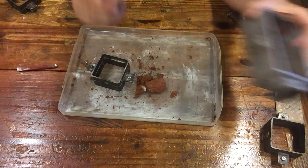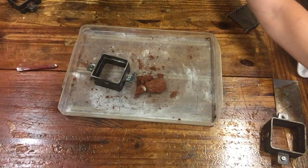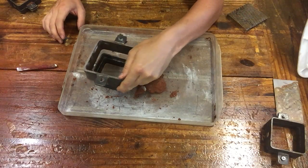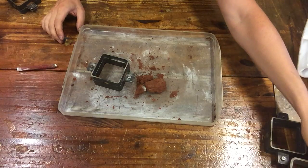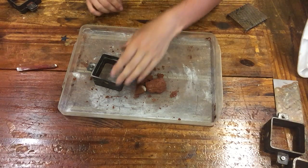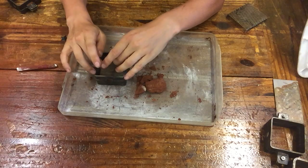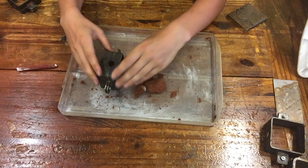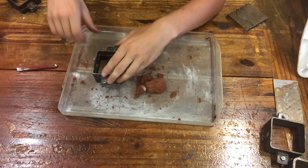If you're doing jewelry in the home studio, this is a good way to go. This is three-inch box tube — they also sell it in four-inch, so you can keep going up in scale. That's how I would go about doing the casting frame, because it gives you the option of pouring from the top face or from the edge face. Everything locks together with the nut assembly, and it's small and modular.